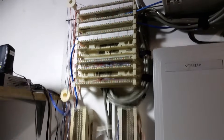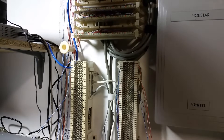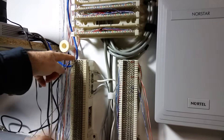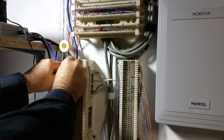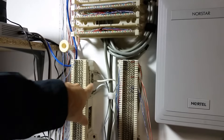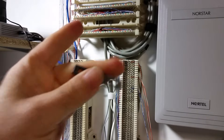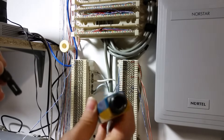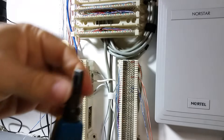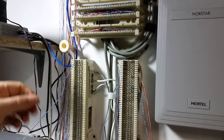So I'm going to terminate up here. I've got my connection made up here on port one of the PBX, then I took the wire and ran it down through the mushrooms — those little white guys used for wire management — and went down to cable one. I put it in on the first pair of cable one. Now I have to switch to my 66 bit. These Harris Dracon punchdown tools have a little socket to switch the blades in and out, and there's a little pocket in the back to keep the other bit when you're not using it. I'm going to punch down the 66.